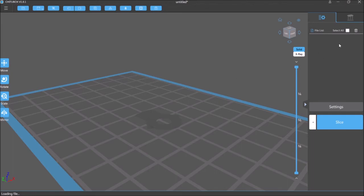When I turn on supports, I can choose light, medium, or heavy depending on the item. You can see how all those little gray dots show how much it thinks it needs for support, considering the surface area of the print. And I could be wrong on this. I'm still learning how to tweak these to get a perfect print.